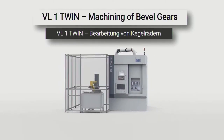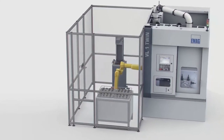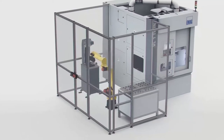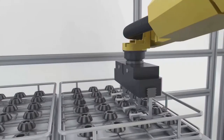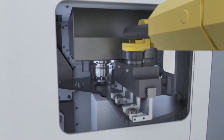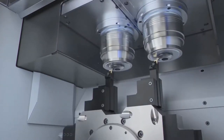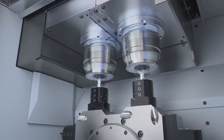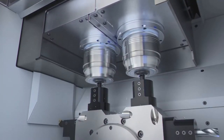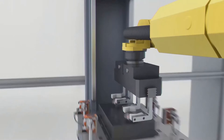The video shows a robot picking from a basket. EMAG offers basketizing systems — not just a simple stationary one, but multiple stacks. You also see a post-process gauge in the robot cell; this could be a wash box or many other things. We load onto the swivel table, pick up parts on the back side, go in for machining — four tools' worth of machining, which could be eight inserts using gang tooling. Very fast processing for small parts, then drop parts off while simultaneously loading the opposite side of the swivel table.